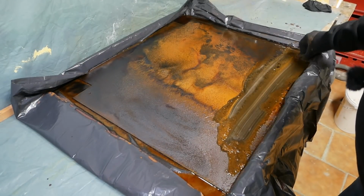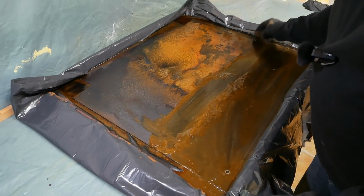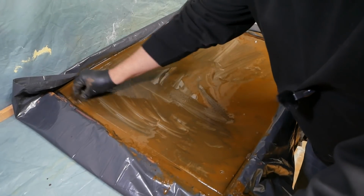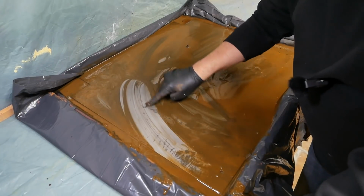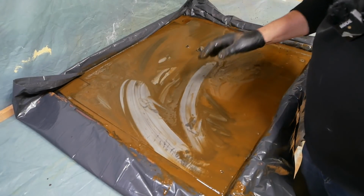Now the mill scale basically just falls straight off. Yeah, up here looks like it's dried out, so I've rubbed this down. But unfortunately, in some areas, I let the vinegar dry on the surface. And where that happened, I now have pitting corrosion. Oh well, I guess I now know which side's going to be the back side that you won't see.